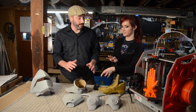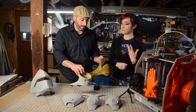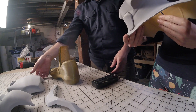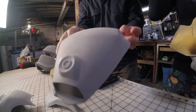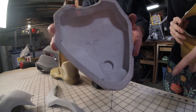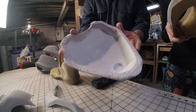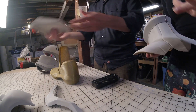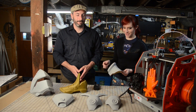These pieces over here were done in a similar manner but different material — same machine. These were all printed on the LulzBot TAZ 5 as well, but in PLA Plus by E-Sun, which is a PLA with an additive to make it a little stronger. On the underside you can see where all the support material was touching. These are all coated with their second coat of Rust-Oleum filler primer to help fill in the visible layer height, which you then sand down, spray, sand down, spray — a repeating process.